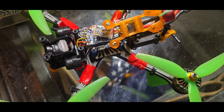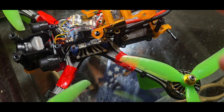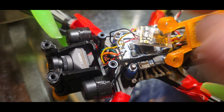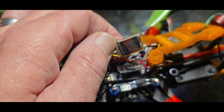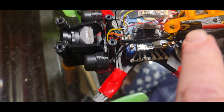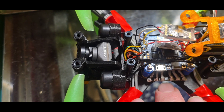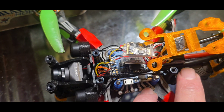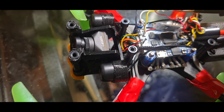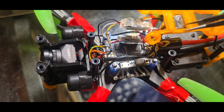I got this running on an Avatar Moonlight VTX. I put a little VTX on here for the thermal camera because it is analog — it's a Rush Tiny Tank that I'm using on this one. I had a little issue with the iFlight stack: when I hooked up the thermal camera, it runs on high voltage, and I'm running it off the vbat. My Moonlight VTX is also running off the vbat.